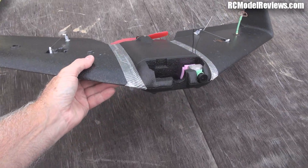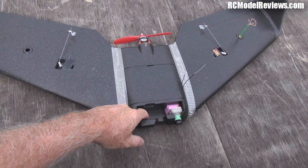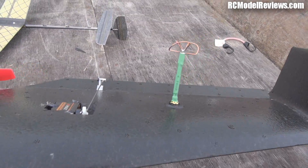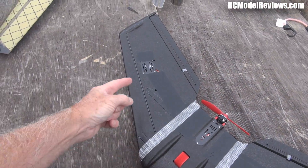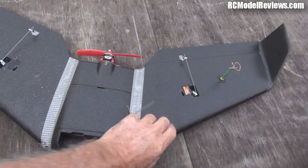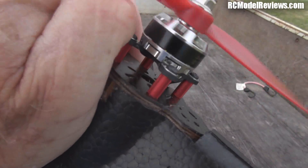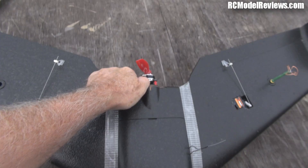I've got the original Runcam Eagle they sent me in the front, and an action camera I'm going to put in — it's just charging. I have my FPV antenna out here; I built one specially for this craft because I didn't have an RPSMA antenna, and I wanted something short so that if it lands upside down the antenna won't be damaged — the fins will protect it. I've got the Sunny Sky motor, but the bearings sound a bit dodgy out of the box — there's a rattle partway around the rotation.